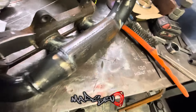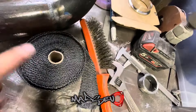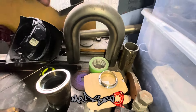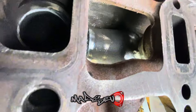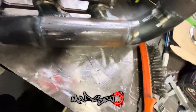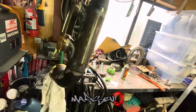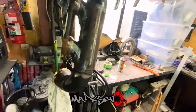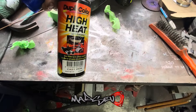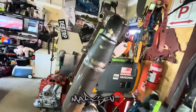She's all welded up now. Doesn't look the prettiest but it doesn't have to — she's all getting covered in exhaust wrap anyway. I'll probably do that later on when I build whatever's going on here. I just have to die-grind a little bit in one of those spots, nothing major, and then I'll give it a coat of paint. Die grinding's all done — there wasn't much in there to be honest. All the runners are nice and smooth, it's pretty good actually.